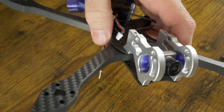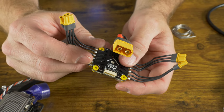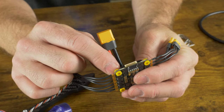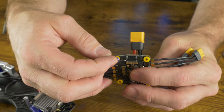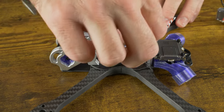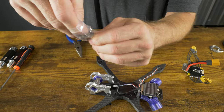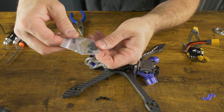The next step is to mount our ESC flight controller stack. We want to make sure we have as much space between the flight controller and the top plate as possible for the battery strap so it's not crushing the flight controller. To get optimal spacing, we're going to use four TPU spacers underneath the flight controller. The F55 amp T-Motor ESC has a two millimeter gummy on the bottom and top, so we need an additional two millimeter TPU spacer underneath to keep the capacitors from touching the press nuts. One of the amazing features of this frame is press nuts in the four locations for the flight controller stack screws — an idea I copied from Alex Vanover.